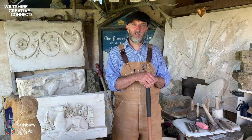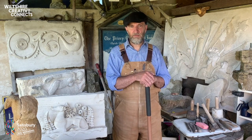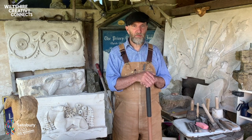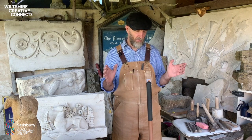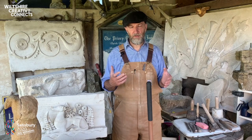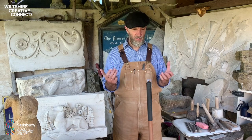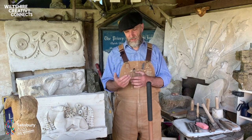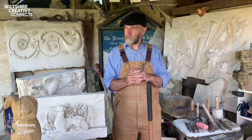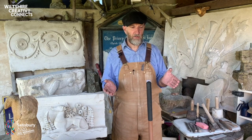These mud walls, built on a stone plinth and topped off with a generously eaved roof of tile or thatch, if correctly maintained, will last for many centuries. Surprisingly, neglect is less troublesome than repair with inappropriate modern materials. What tends to happen is that if a modern cement render is applied, or replaces a traditional lime render, the cob wall inside suffocates. There's no possibility of vapour transfer. So it suffocates, it becomes saturated, it slumps, and it causes the cement render to fracture. Fractures can very rapidly lead to localised or even whole-scale collapse.